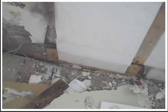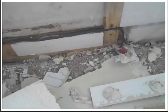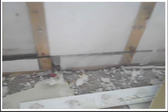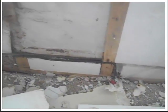Just a mess. Okay, and look at this wiring. See the wires? How they put the wires in? Look at that. 1980 this was built. You know? I mean, that's not really code. It goes to an old electric heater, I guess. That's been disconnected, of course. And that went to the outlet. Look at that. Just left it vulnerable to the elements. No metal pipe or anything. Just ran it. Cut the furring strip across after it was on there and put the wire in. Man. Okay.